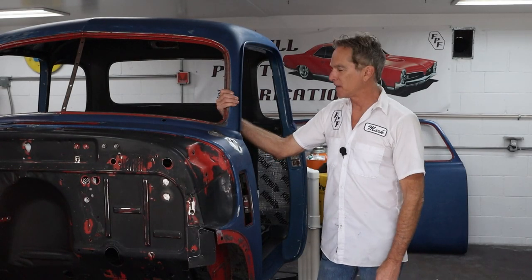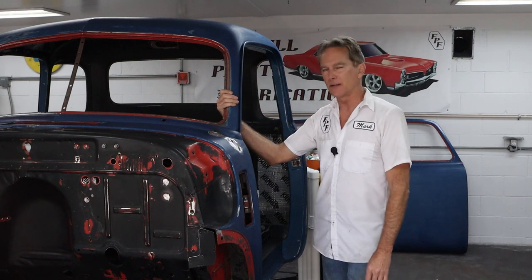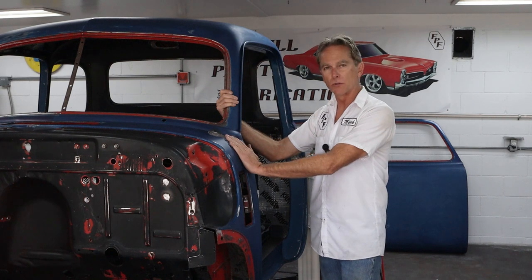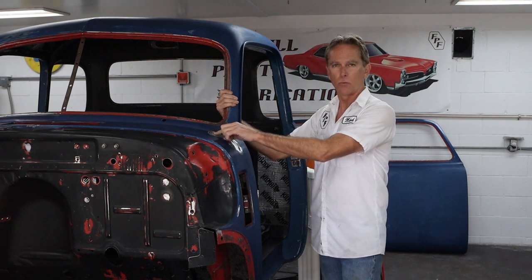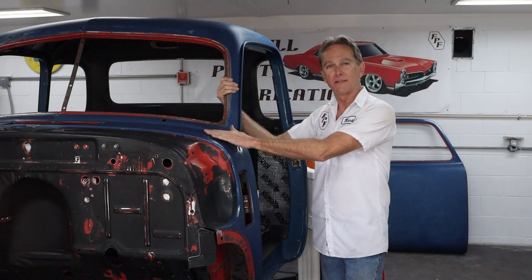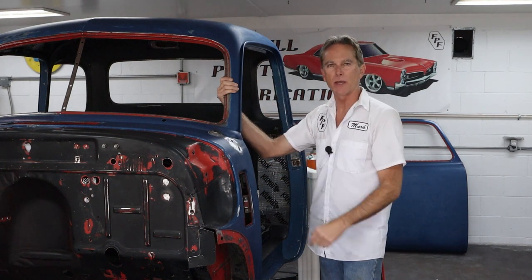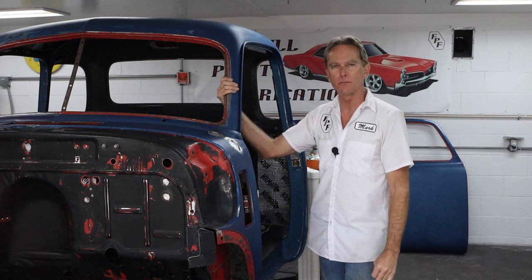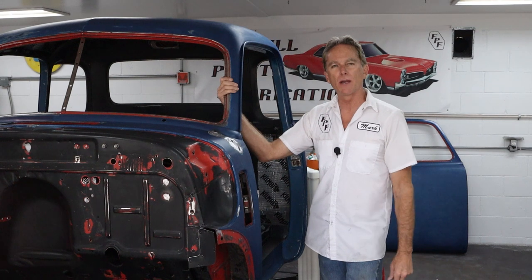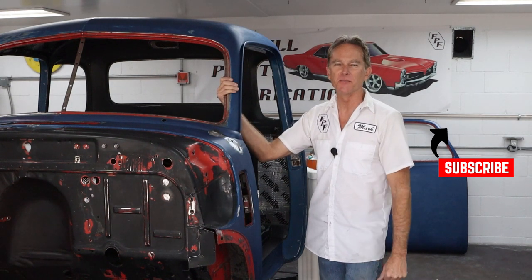That just about wraps up this video. We've got one more hole down — I think we only got two left to go, that's going to put us at 35 holes total when we're done. There are a lot of holes in this cab. But we got the mirror mount bent back up and the brace behind it pulled with it, so when it goes back together, that should work out just fine. Got the antenna hole welded in — you guys got to see me brutalize some TIG welding there, but I'm going to keep practicing. Didn't blow a big hole in it, so I'll take that as a win. We'll go ahead and fill these later when we fill the patch panels — mix up the filler at the same time and do them all at once to save labor. Thanks for joining me here at Foothill Paint Fabrication. If you haven't subscribed, please consider doing so, and if you like what you saw, give a thumbs up.